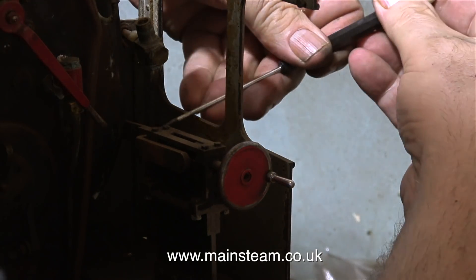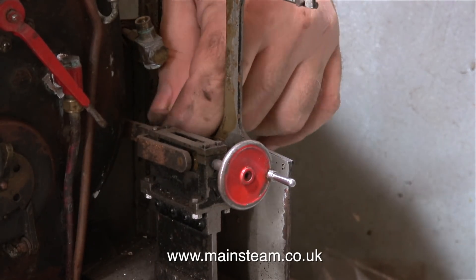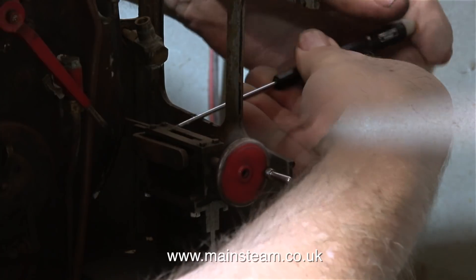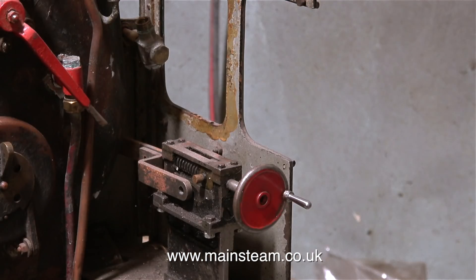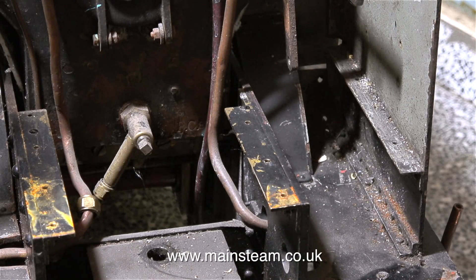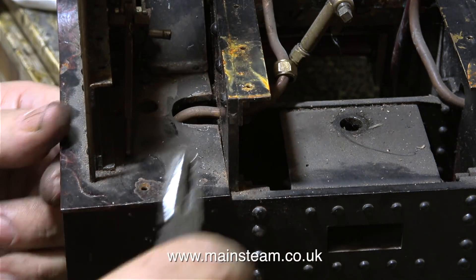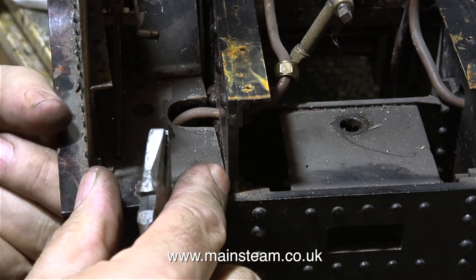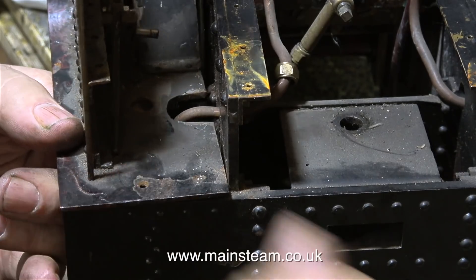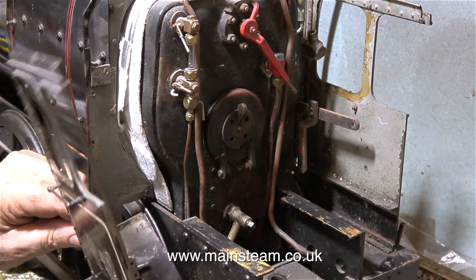The design of this part of the engine is a bit weird, really. I would normally mount things like the reverser to the frames, but this reverser, along with the drain cock lever, is mounted to the floor. So what I'm having to do in this case is remove the reach rod, and I've temporarily bolted it back together so I don't lose the part. All I have to do now is just slide out the floor complete with the screw reverser. The drain cock operating lever was also attached to the floor, because the sequence in which this engine was put together allowed that to happen. But now, pulling it apart, it's not quite as easy. And as usual, the last bolt was the most difficult to get out — it wasn't fastened to anything, it just wouldn't come out, it was stuck in the hole. But with a bit of persuasion, finally the cab side came off.